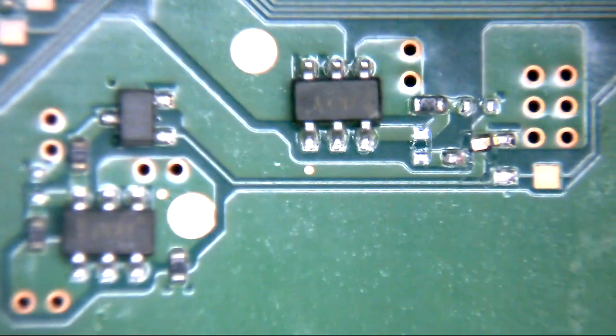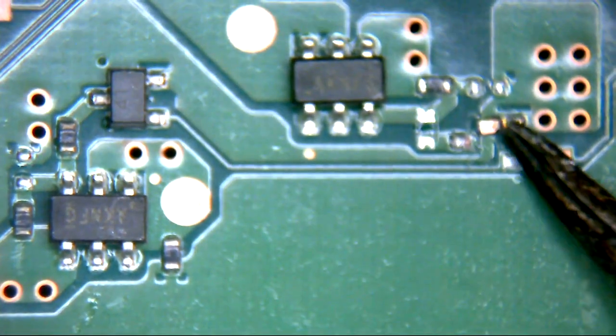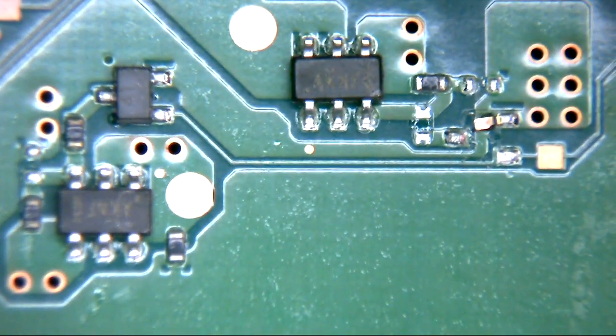Okay, so let's have another look at one of the older boards then. If we think it's coming from our Southbridge, let's take a look at one of our older boards and see that portion of the circuit. Now this one isn't completely intact, but it's not far off. The only difference here is that there is another one of these little packages down here on these three pads. Otherwise, I think there's a couple of resistors missing as well.